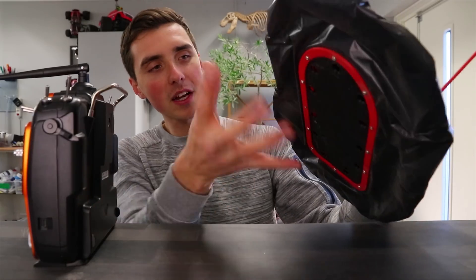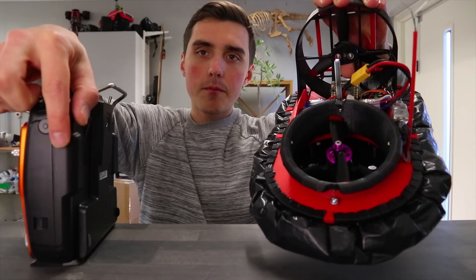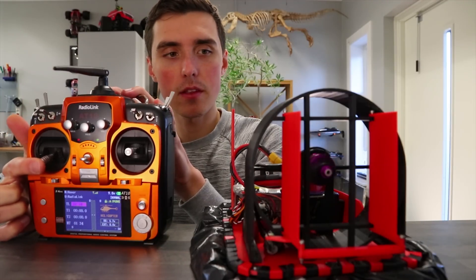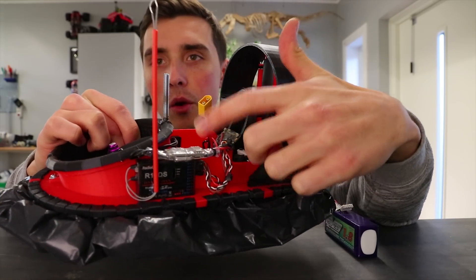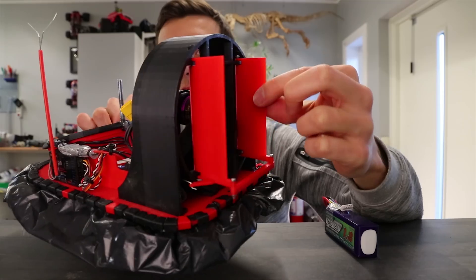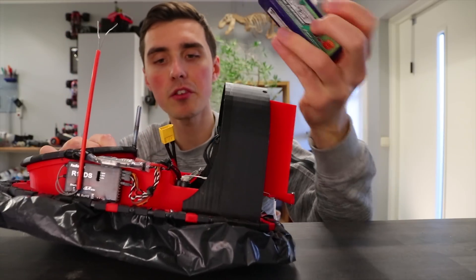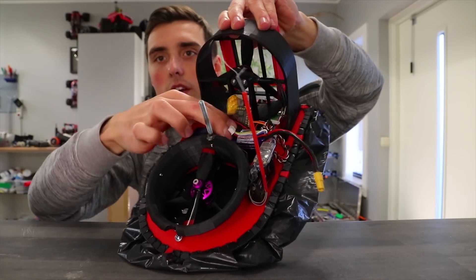To enter hover mode and inflate the skirt, I rigged up the duct to this lever here. We've got steering left and right on this stick and gas forward on this stick. Here's where I placed everything: the receiver right here with the antennas popping out, one ESC going to this motor, and the servo right there hooked up to the rudders. I placed the power distribution board right here — it fits almost perfectly — and I'll be using the 1800 four-cell battery, and that just sits in just like so.